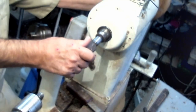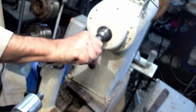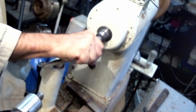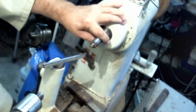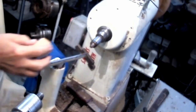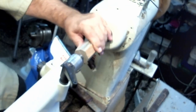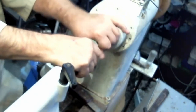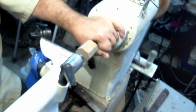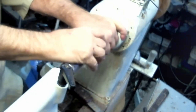Smaller just doesn't work. And you put them on just by, I drilled the hole, just like I showed you. I drilled the hole, and then I just have to thread it on. Well, I normally cheat a little bit and power up the lathe a little. This isn't one I drilled for this program. You drill a hole that is a little bit smaller than 3/8. And because I still haven't found my package of parts to do this with, because I have a box of parts dedicated to doing bottle stoppers, I'm kind of winging this a little bit. I don't have the right drill sizes and things, but it's not an excuse. I'll start by getting a little tailstock pressure on it. Once it starts threading, it just walks itself in.